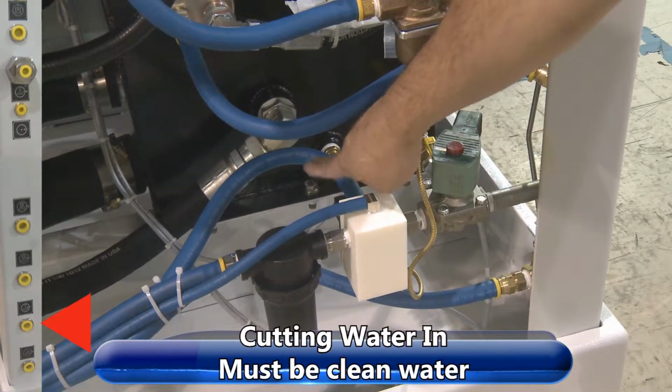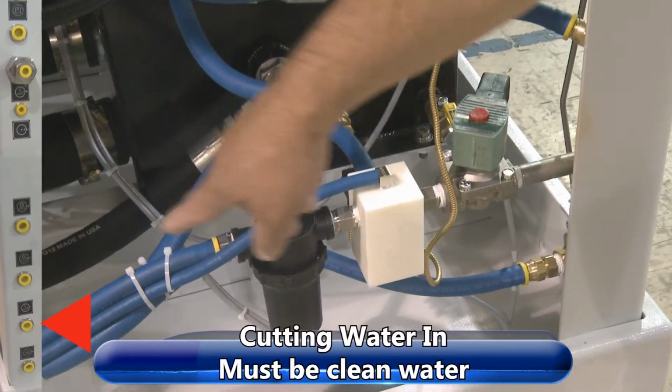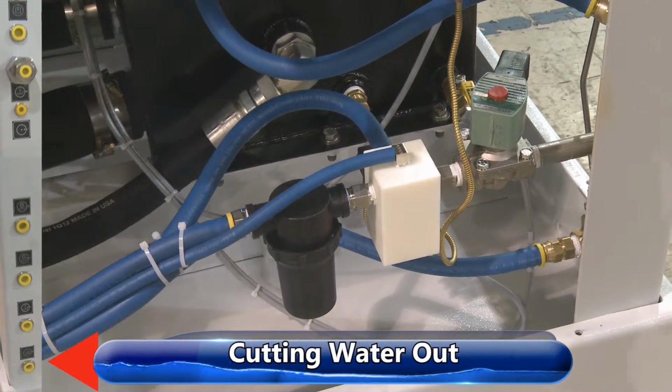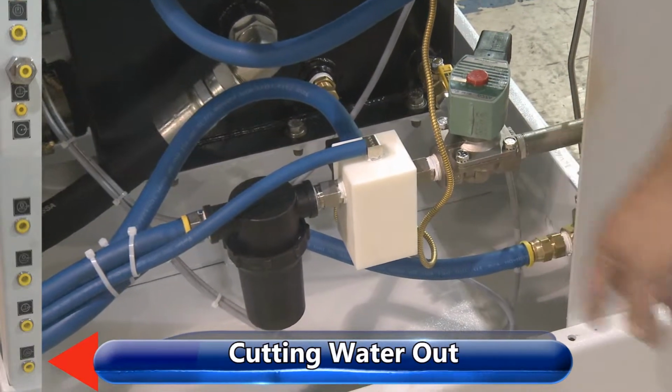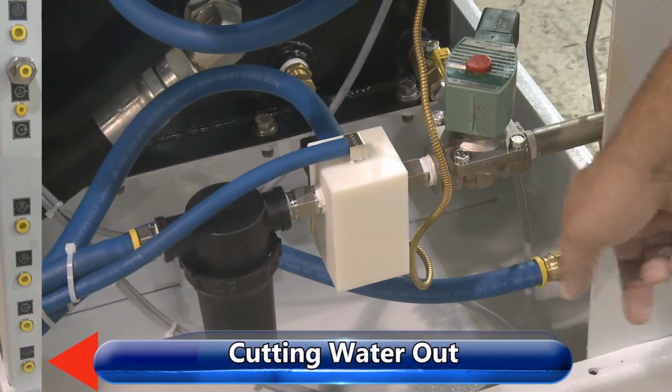We have a 30 psi switch here. We have a strainer here, and then it feeds your booster pump and your little manifold up there for your top works. And then we have the bottom drain here for the relief valve, overpressurization valve, and the dump valve drain.